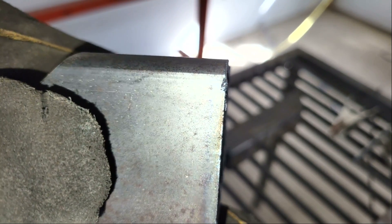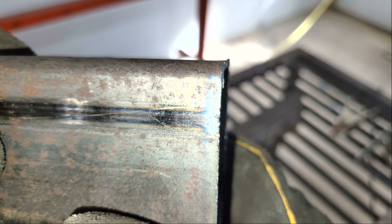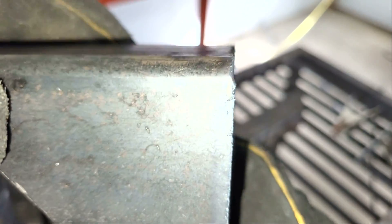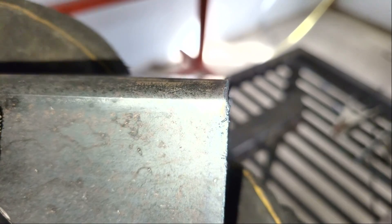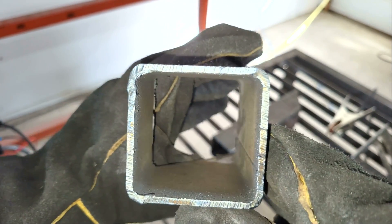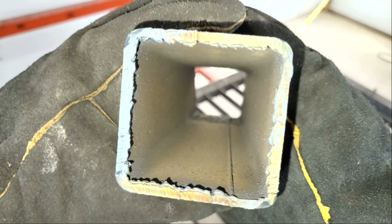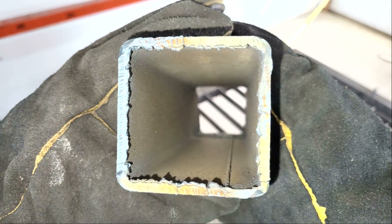The torch cut through the tubing without any trouble. There is a bit more dross than there should be, but that's on me — I think I moved a lot slower than I should have, and given that this is the first cut I'm sure these settings aren't optimal. I'll have to spend more time adjusting and testing to find the sweet spot for different materials and thicknesses, but I'm happy with this for now, so I moved on to cutting a rusty piece of 6mm steel plate using 28 amps at 38 psi.